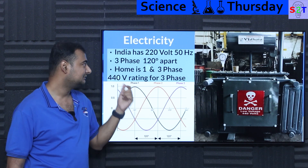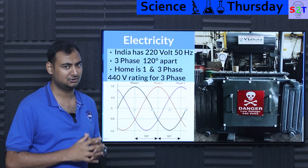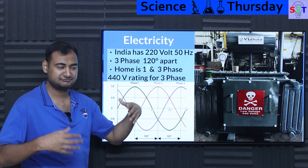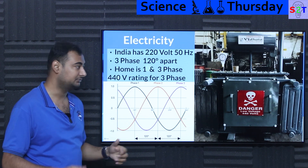How small can it go? Well, airlines use 400 hertz because that allows them to make all the pumps, fans, and electrical equipment much smaller. So that's why 50 hertz versus 60 hertz matters. Why would you want slower hertz? Things travel further and have less skin effect, so we generally prefer 50 hertz for home distribution.